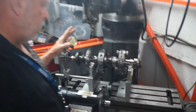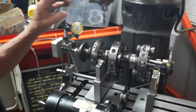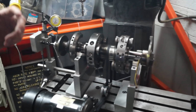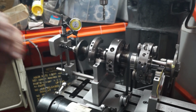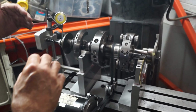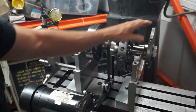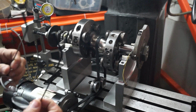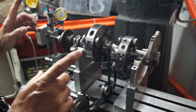This is basically the crankshaft for this RX8 with the bob weights set up for their weight. Once they've been balanced, and take into consideration the oil, the weight of the oil, and the weight of all the seals. We'll set up the bob weights, and then go ahead and make the corrections on the actual counterweights. I already got the majority, like 100%, 99.9% of the work done.